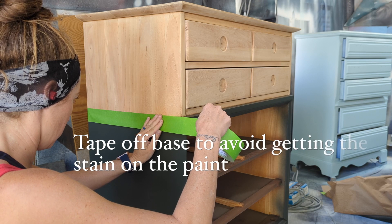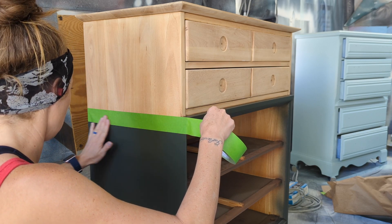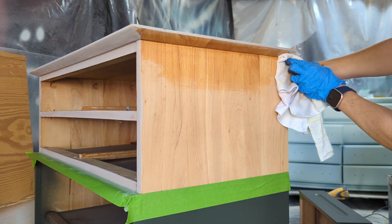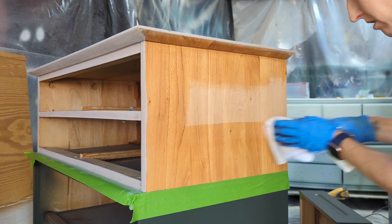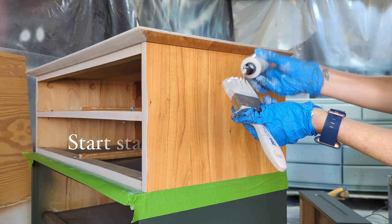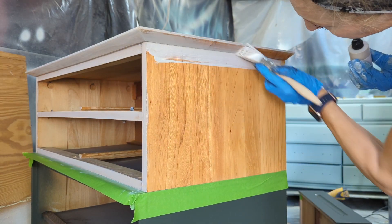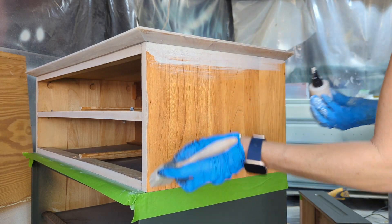For the finish on the top I'm using Lily Moon's white oak barrel stain, and I'm going to tape off my paint so it's protected. If you're a beginner and you might drip, put paper underneath as well. Right here I'm getting the surface wet — when you're using a water-based stain like Lily Moon's, Minwax, or any water-based stain, it really goes on like paint and will get stuck if it doesn't have the water underneath to work with it. Wet your surface down and then begin applying the stain.